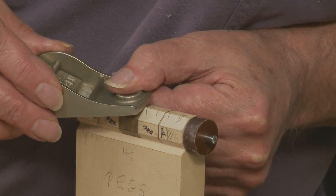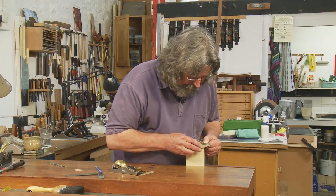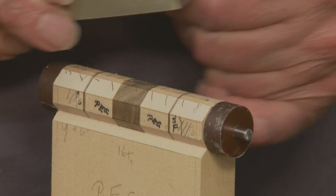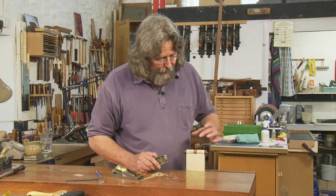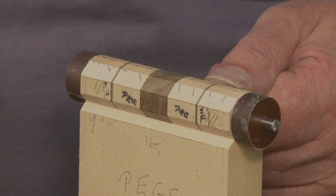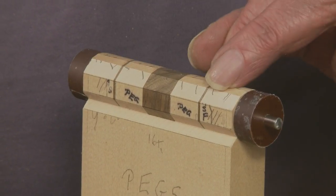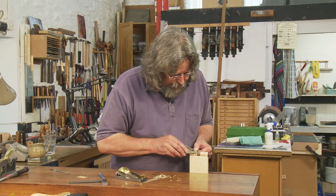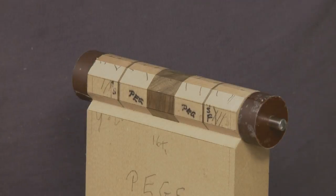I want to try and sit at an angle between those two surfaces. The pencil shows me what I've been removing and I can see that it's a nice parallel facet, so I don't think I need to make adjustment. Possibly it's a little narrower here than there, and that final shaving caught the sellotape. So I'll have two more off at this end, stopping and leave it at that.